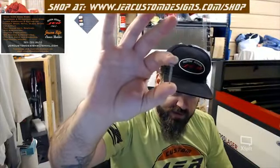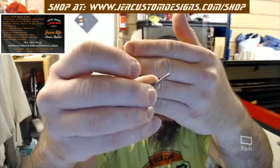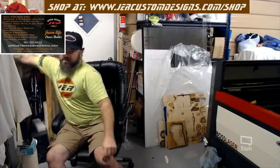So basically, when you get this kit, you're going to get 6 of these screws. I don't know, they were sold as M4s, but they're just standard self-tapping screws. So once you drill your 1/8 inch drill bit hole, you put this in there, tighten it down. And the rail itself, you should have no problem using what is this? I think it's a quarter inch socket. But I use these drill drivers. It fits perfectly in there, and this in and of itself is made to where you have plenty of room.